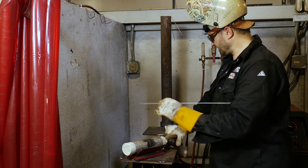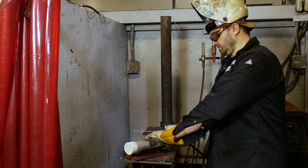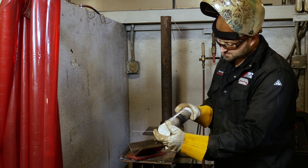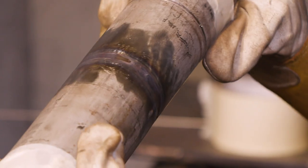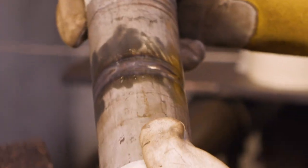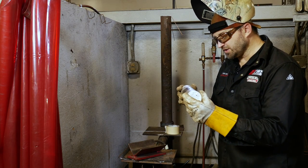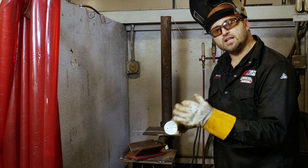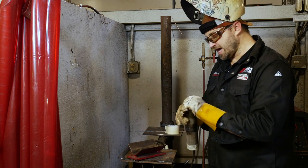Turn our purge off, shut that down, pull that out. Nice little stainless steel two-inch pipe. Like I said, it takes a little time, takes a little practice. It's very easy to mess this up, so take your time practicing this. It's really just about watching the keyhole, watching your little pinholes — don't leave any pinholes in there. If you've got a couple little low spots, you can always come back and add a little wire and clean it up, but it's actually pretty good, all looking good. We can rip it open and take a picture of the inside and see what it all looks like.